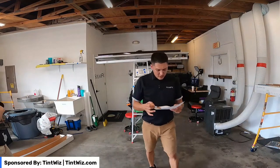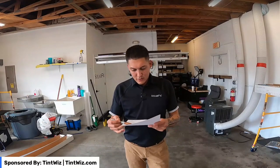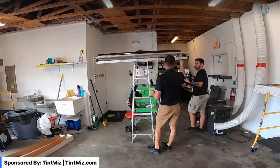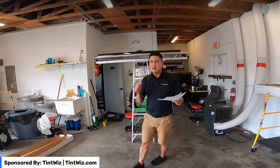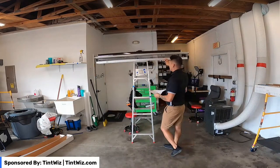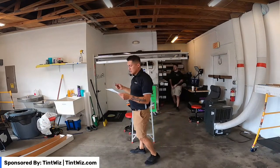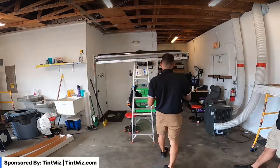Next dimensions: we have 47 by 68, then two 44 by 88s, and then three 44 by 90s. So with the measurements we have, we're going to lose about 28 inches on the wider cut as spare — we'll save it for a future job with maybe smaller windows. Always double-check and make sure whether it's going to be a 48-inch, 60-inch, or 72-inch roll — which one's going to be most effective and efficient. That's the most important thing: efficiency.